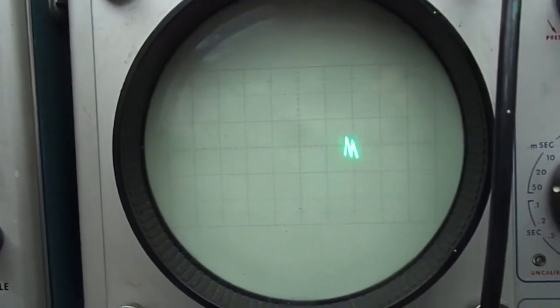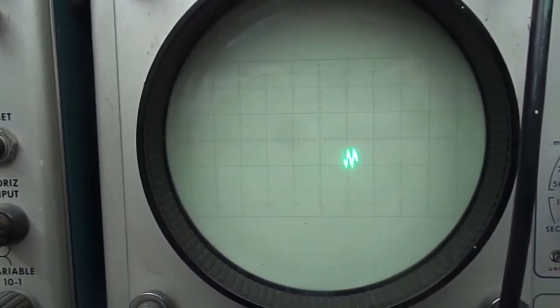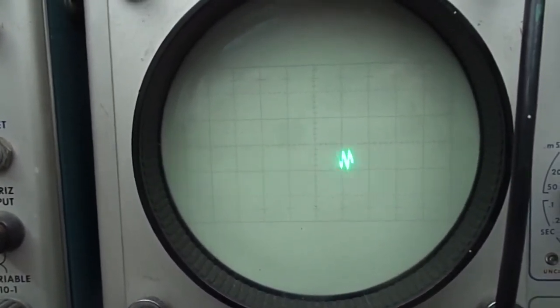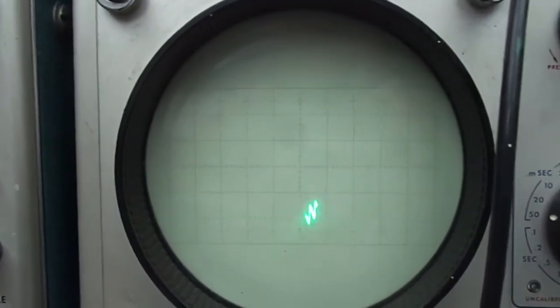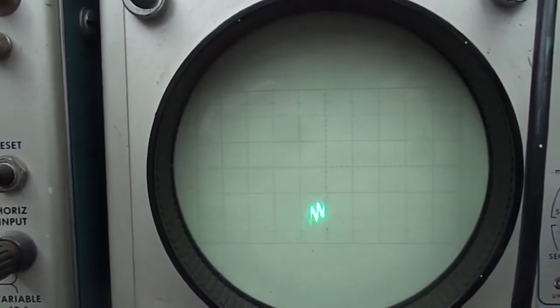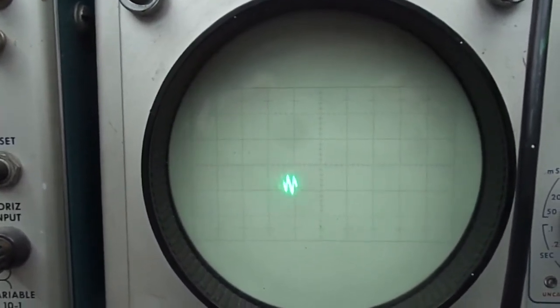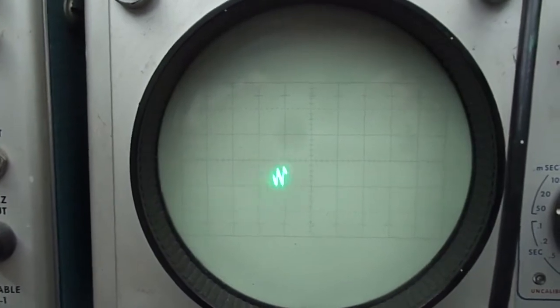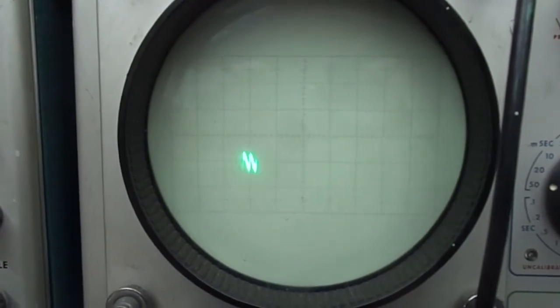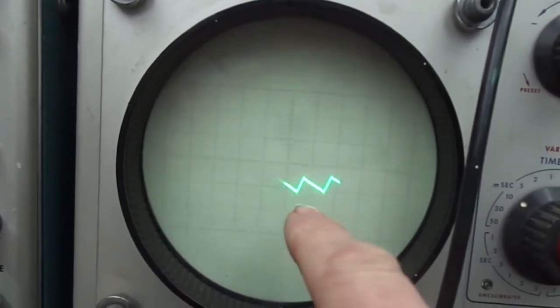So we've got the boingy boingy, the oscillating, which seems, there we go, 1, 2, 3, 4, 5, 6, 7, 8, about 5 or 6 scans, which, we were on 50 milliseconds per division, so that's about 250 milliseconds, you get the idea, look, it stops. So we've got two issues. We've got the sawtooth wave when it doesn't want to be.